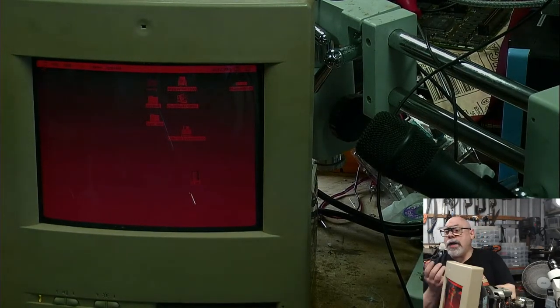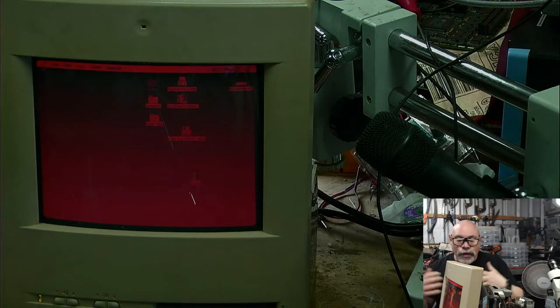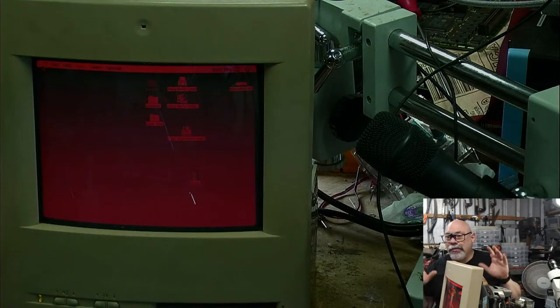And so I want to inspect the analog board on the microscope and look out for any damaged or cracked traces that might be causing this. Because generally when you're having these problems associated with intermittent wobbles and that sort of stuff, it can often be cracked solder joints, especially with this one that I know has had a fair bit of corrosion on it. And it also generates a lot of heat. Sometimes the heat can cause the cracked solder joints.